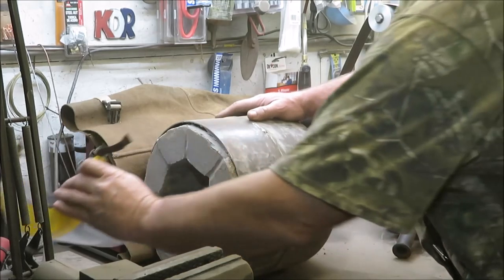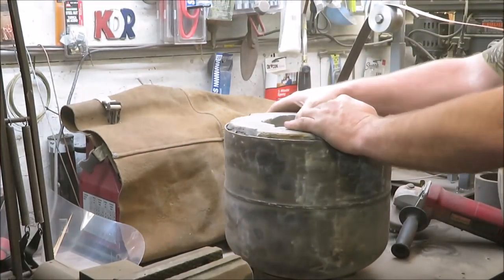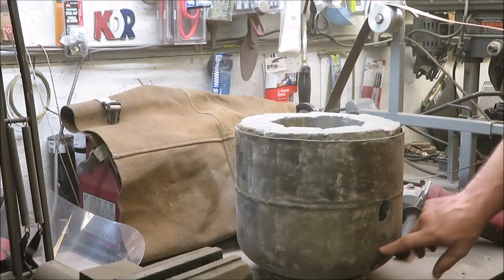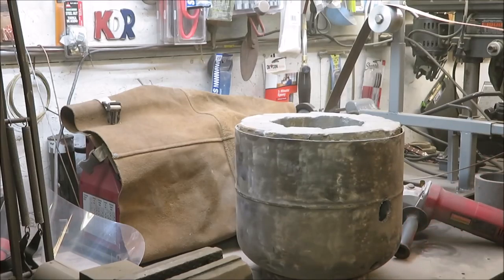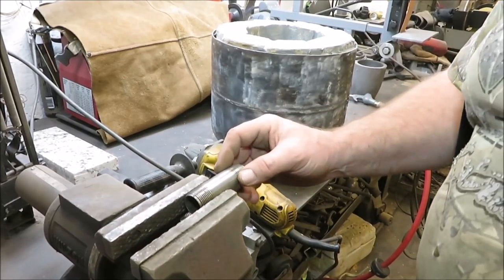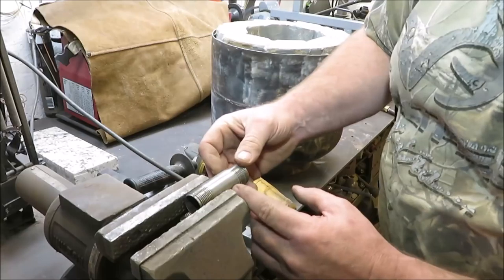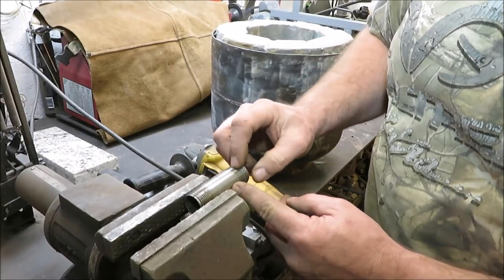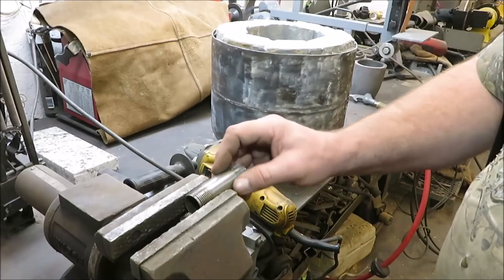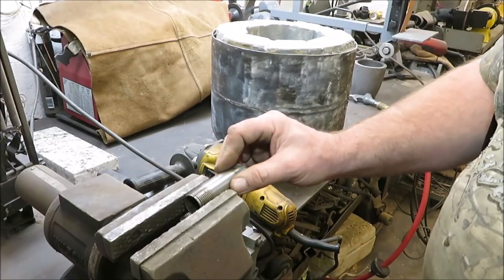She's looking good now — got all that nasty stuff off of there. Now we're going to get it wiped down, do some grinding around these and go ahead and get some stuff welded on there. We've got a piece of three quarter inch pipe here. I'm going to cut it about a half inch or so away from the threads and we're going to weld this onto the bottom of the tank so we'll have a drain plug in case a crucible breaks or something.